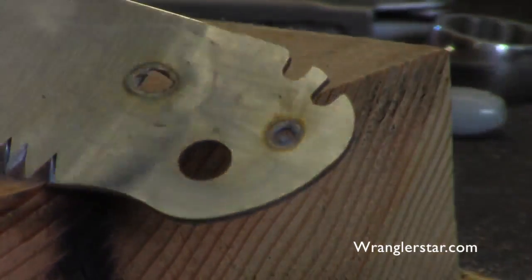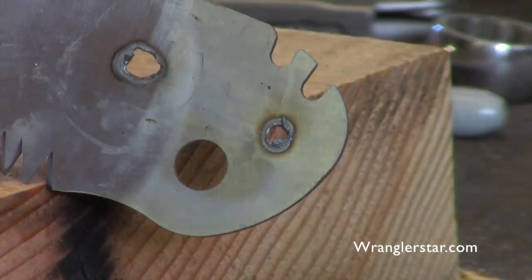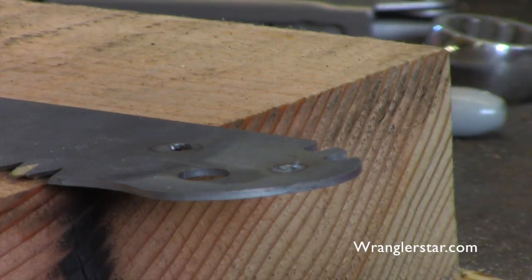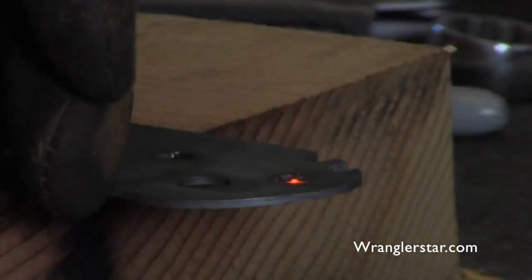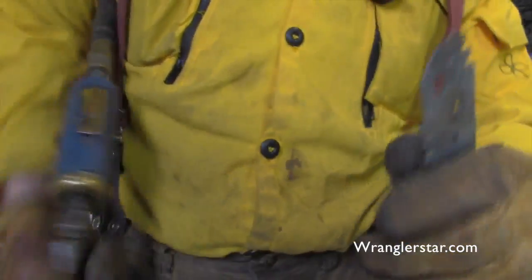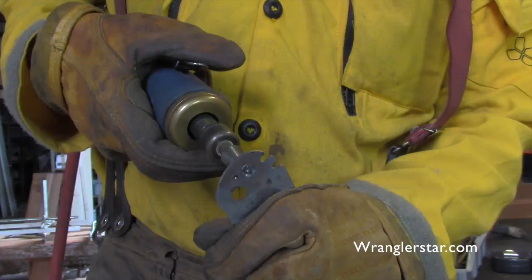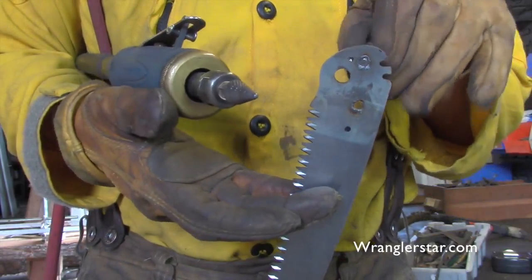You can see it makes a very precise little hole with no effort. It's not super clean, but that's okay — I'll be conservative and do a small hole, then take the carbide die grinder to clean that out just until we can get the bolt in. Our bolt isn't going to fit through there yet, it's a little jagged, but once we have a hole established the die grinder shouldn't have any trouble rounding that out.